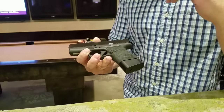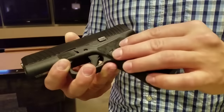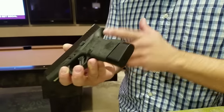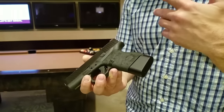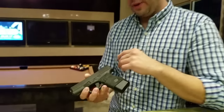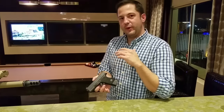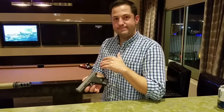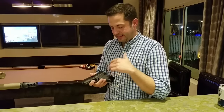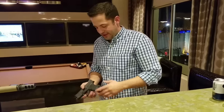We put our micro stipple. This makes it easier to grip if you've got sweaty paws, but it's not something that will rub you raw — it's not super aggressive. One of the reasons we don't stipple underneath where the web of your hand would go is because that can really start to aggravate the web of your hand after more than a magazine. We do the whole gun, but we do it with a CNC tip so it makes a super fine pattern — almost like shark skin. It doesn't catch on T-shirts and it doesn't rub your body too bad.